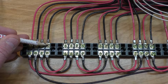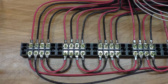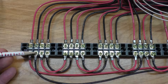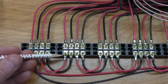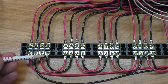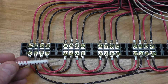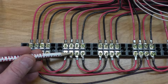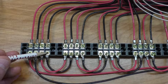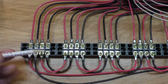The black wire here is the end of the cable coming out. Each one has its own individual terminal block. I've got jumpers joining the beginning of coil number two with the end of coil number one — that's the copper. Same thing for the black: the beginning of the cable on coil number two joins to the end of coil number one, and it goes down the entire line for all twelve coils.